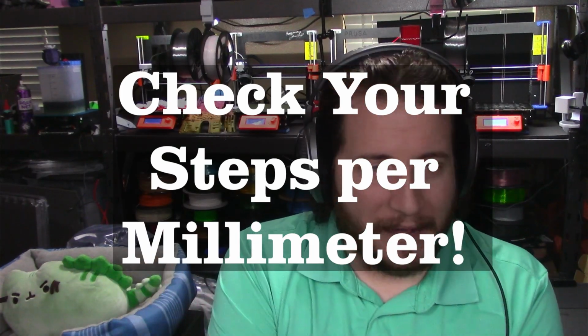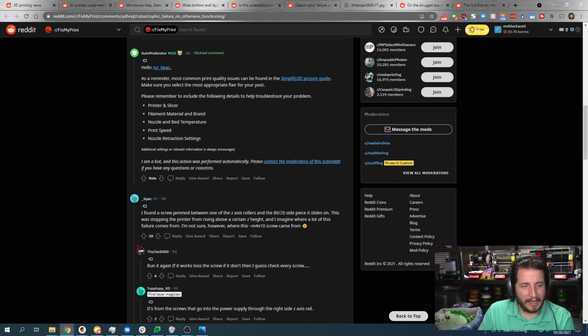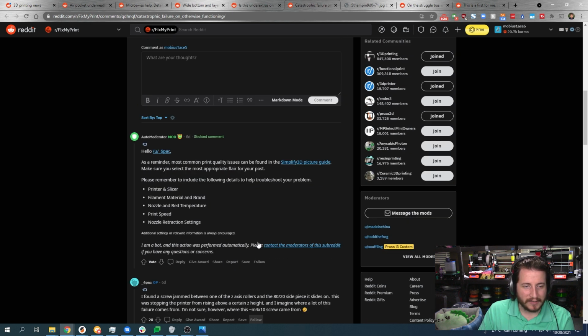So make sure your steps per millimeter are set. And that's actually a pretty good, consistent thing with this video. It's all about extrusion and steps per millimeter. Anyways, this is just a catastrophic failure, and let's see what they say. Found a screw jam between one of the Z-axis rollers and the 80/20 side piece it slides on. This was stopping the printer from rising above a certain Z height, and I imagine where a lot of this failure comes from. I'm not sure, however, where this M4x10 screw came from.